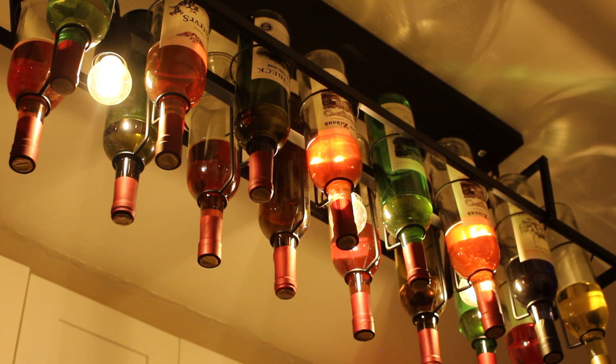One thing I must point out: for this to properly work, you need to make sure you have dimmable light bulbs — that is really the key. You need dimmable light bulbs and a dimmer switch; you need both for it to work properly. When you're able to dim a light, you can really change the setting and feel of the room. Honestly, when you dim the lights especially with these wine bottles, you give a different, more romantic and elegant feel to the room. If anybody found this video interesting or helpful, please drop a like, comment, and subscribe — I'll catch you all next time.